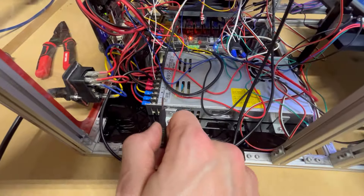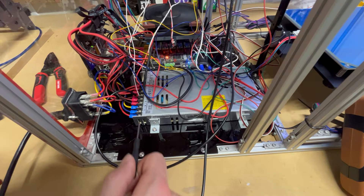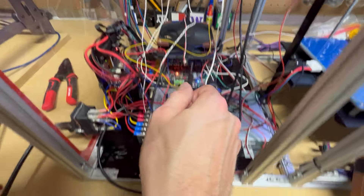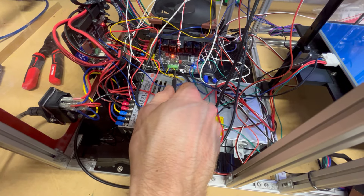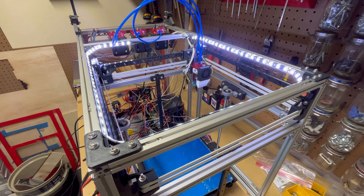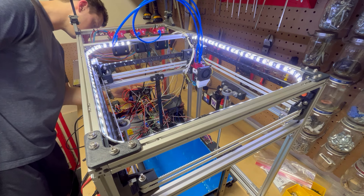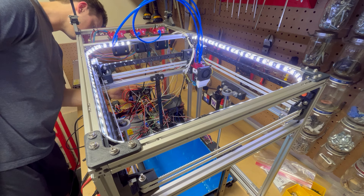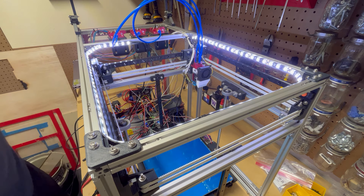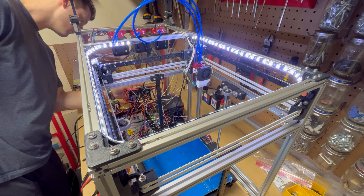Maybe if my printer was going to be used in some haunted house — but for now, there would need to be a more direct way to provide the lights voltage. We're going to have to go old school on this one and use a switch and connect directly to the power supply itself. Right now we don't have the switch, but I'll install it later when we do. I do have the lights working as they're connected directly to the power supply, and when the heater is turned on, we don't have any of the flickering. I'll go into more detail on this installation later.